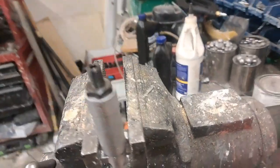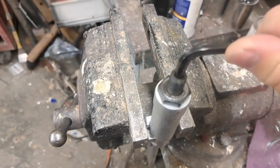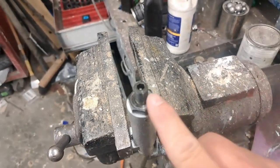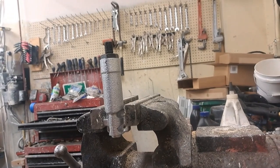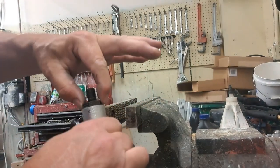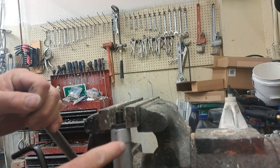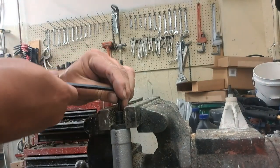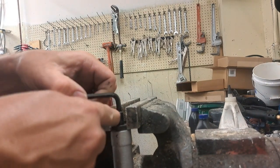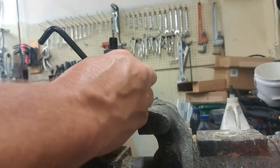So this is still on your machine — it's going to look just like this. We're going to make sure that this is tight and has already been adjusted to the pressure that you need. Now you've got to put your knob back on. You're going to have the Allen wrench that you use to tighten it up. Tightening is clockwise; counterclockwise is loosening the pressure. Once you have adjusted to where you need it to be, if you put this in a vise, you've got it good and tight, and you can use the vise to hold that while you loosen your set screw inside the housing.